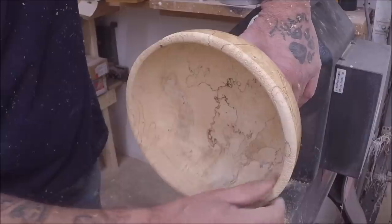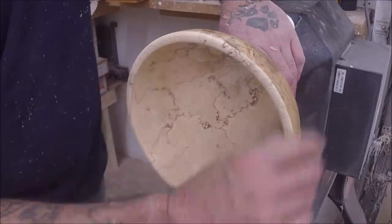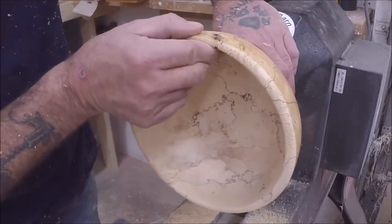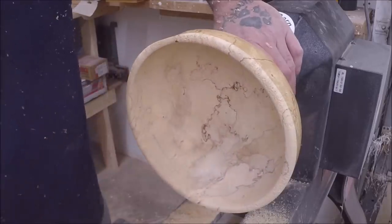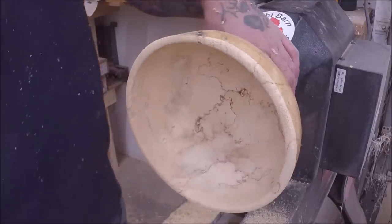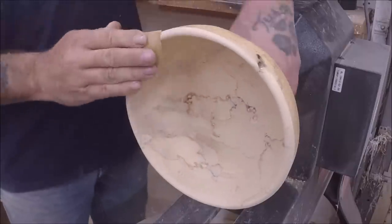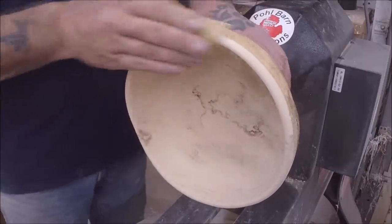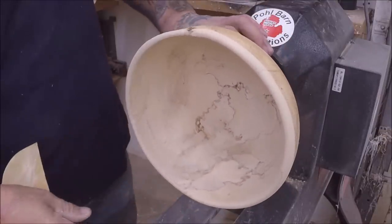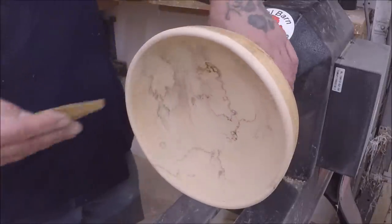I really don't want to push my luck anymore. I've got quite a bit of sanding to do to get this tear out out of here, and it sounds like it's cracking. This is a little thick but the vibration I'm getting out of it — I don't want it to blow apart. I'm going to leave it like that, because this part isn't even connected. I'll drop some CA glue down in this side and call it good. Some is softer than others; the soft stuff's coming off way faster, so I'm going to hand sand the rim here.